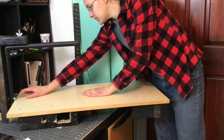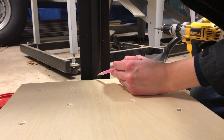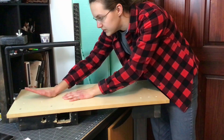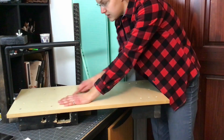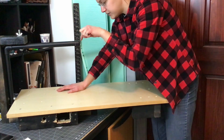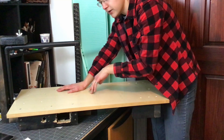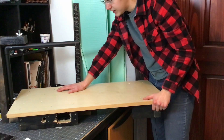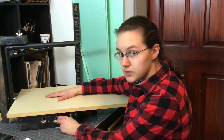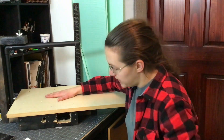As you can see, it slides right on there. I chose the location of this hole to be just above the table so it's kind of pivoting right above the table. It might be a little bit too low — I wouldn't mind having it a little bit higher for some clearance between the table and it, but that's all right. This slot here is for the wire. I cut it using a table saw and it will allow the wire to drop right through there. If I want to take this piece off for better storage, I can slide it out without having to take off the wire. I carved a hole for a dimmable light switch and a power switch, and I also added a few holes for zip ties to keep all the wires organized.